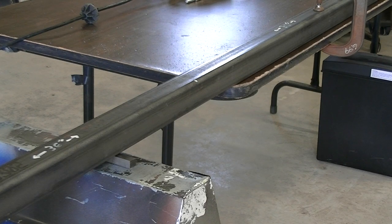I'm using a 14 tooth per inch blade on it. It seems to work quite well. If you get too aggressive, it wants to cut too fast, and that's where you start having troubles with it wanting to cut on a taper. This seems to cut aggressive enough that you're not staying there for 10 minutes on one cut, but at the same time it's not going through so fast that it's making a big taper.